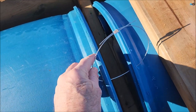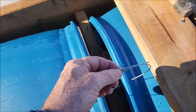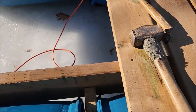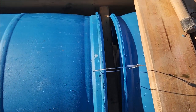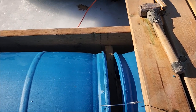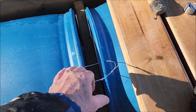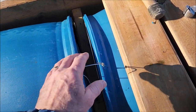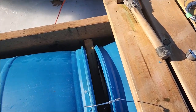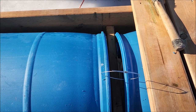I'm putting a little aircraft wire — it's eighth-inch wire with a little cleat — and I just use my hammer to pound them together. What I'm hoping that'll do is provide a very strong connection between the barrels, and that is over top of the 2 by 4. So in the summertime, if we had a violent storm and the dock got rocking so violently that a barrel would want to pop out and escape, this will prevent it. It's locked to the next barrel over top of a 2 by 4 — so unless that wire breaks or that joint breaks, it's not going anywhere. However, it could free-float around. Anyway, that's how I'm going to try and protect the barrels for now.